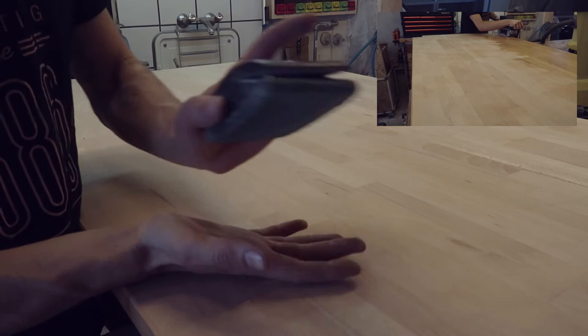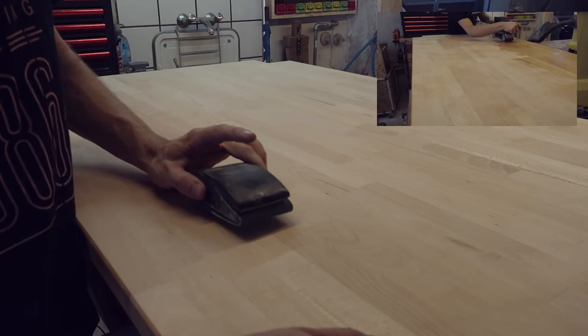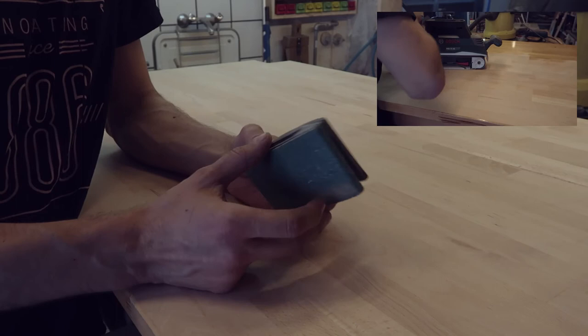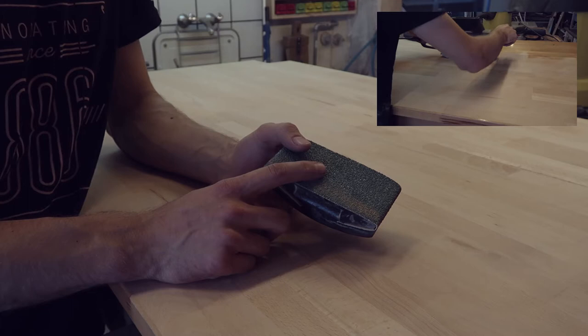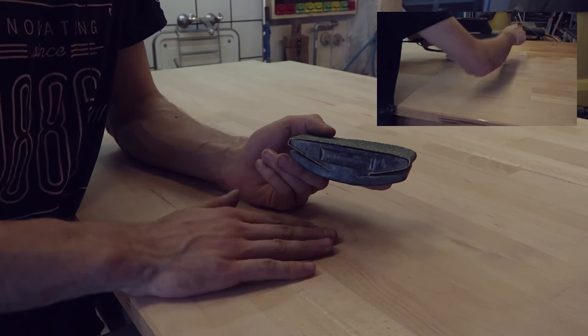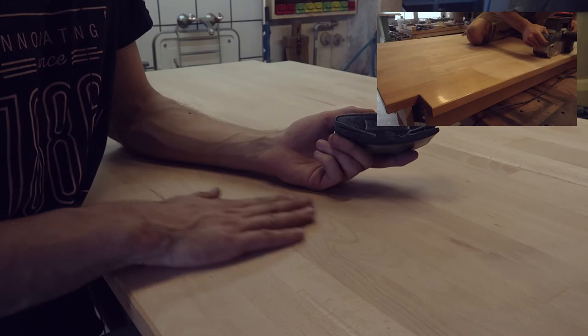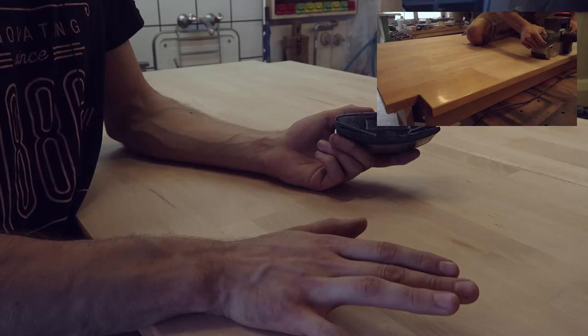And so what that means is you want to go along the spaghettis. You don't want to go across them, because that'll break all of them and tear the wood fibers. The next thing is sandpapers. There's tons of different kinds. The lower the number, the coarser the grit. So you want to always start on a coarse grit if you need to remove a lot of material, and then incrementally step up finer and finer until you think it looks good, or until you get bored of sanding. I find for wood going up to around 240, 320 is more than enough.